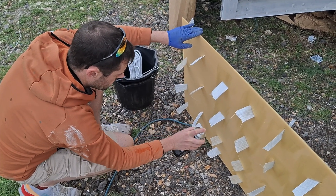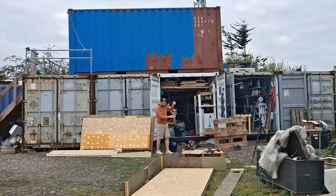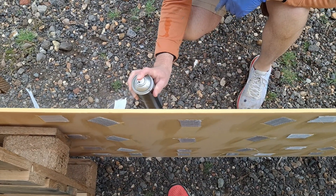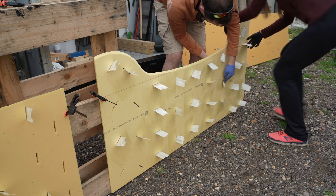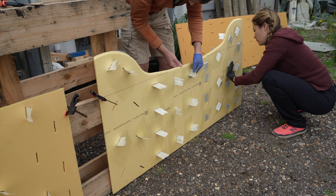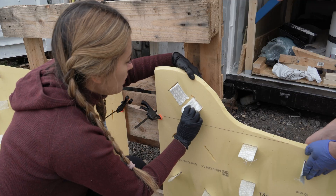Then we needed to flatten them down. I'm using a premium resin compatible spray, and doing so sparingly as it's premium. Although a handful would need to be a U shape either side of the foam, the majority can be an S shape. Fibres are always at their strongest the flatter and least crimped they are. This went on for a while, but it's quite cathartic, and the least taxing task for our prep day.